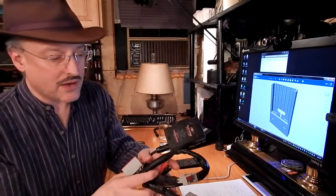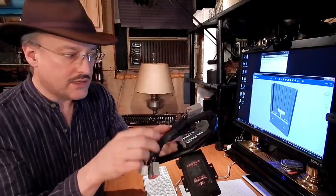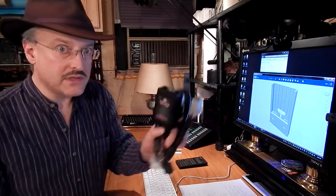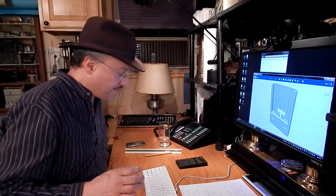Now this radio has a satellite radio ready port on the back, and this product has a harness that plugs into that port and then plugs into the harness on the car, and a converter that takes the output from that satellite radio and puts it on a couple of RCA plugs. Unfortunately, apparently the style of radio in my car changed mid-year, and the particular one that I have is not compatible with this device, so I was not able to use that.